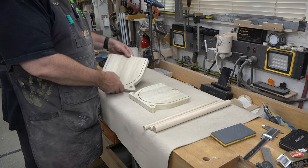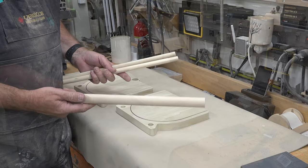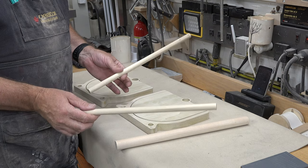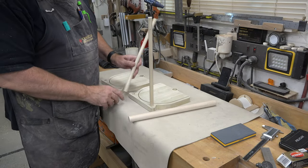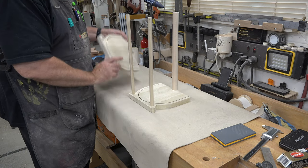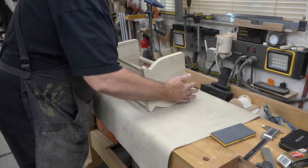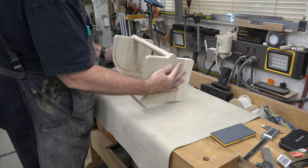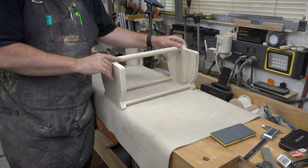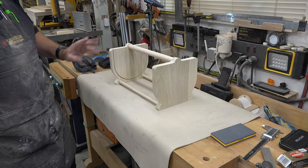After sanding and cutting the perimeter, the next pieces needed are a one-inch diameter dowel 15 inches long and two five-eighths-inch dowels also 15 inches long — these insert into the holes drilled in the inner layer. Clamp everything for a dry fit, then using the countersunk holes, drill pilot holes into the dowels to accept the number-eight screws that will hold the frame together.